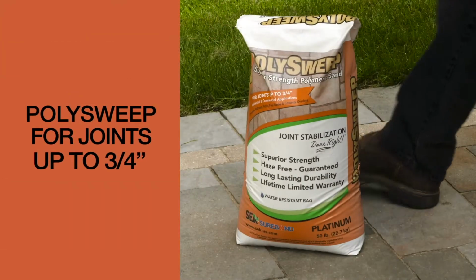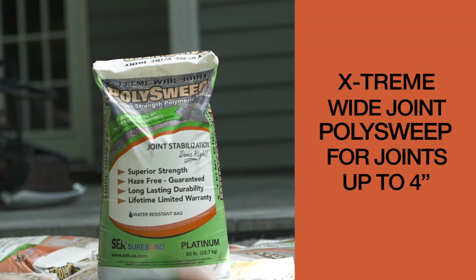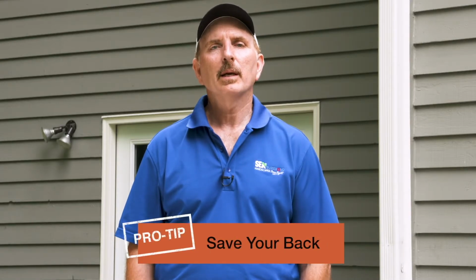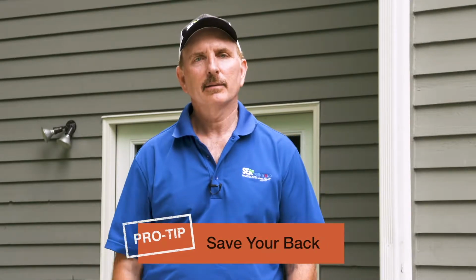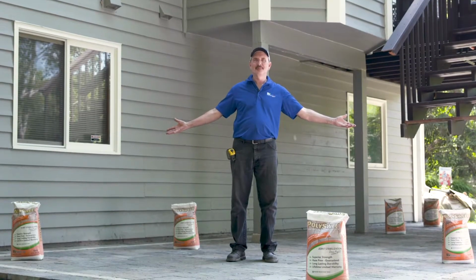Use PolySweep for pavers for joints up to 3/4 of an inch and extreme wide joint PolySweep for joints up to 4 inches. When you're ready to apply PolySweep, here's a tip: save your back. Stage the 50-pound bags evenly around your surface. Then cut open and distribute each bag low to the surface, forming an S pattern as you pour, within a small area.